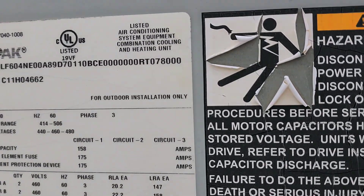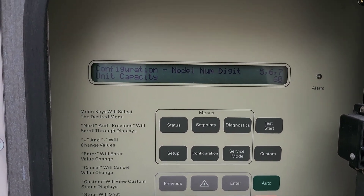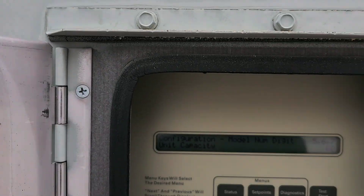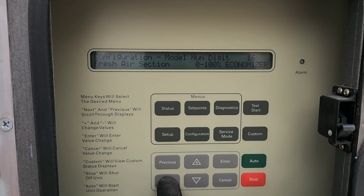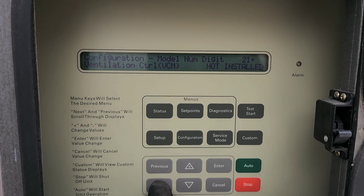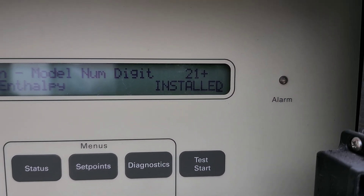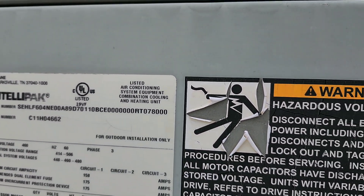After you're done with the major selection, hit enter, then next — type of heating. Obviously the second digit, enter, next. Five, six, seven — capacity. This one is 60 ton. I'm not going to run through everything, but you get the idea. Comparative enthalpy, which I installed — this is where it gets a little different. It says 21 plus, meaning 21 through 38, so you literally count it and work your way down. All the zeros just means a lot of options weren't chosen.